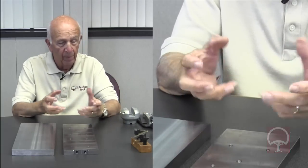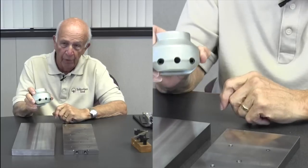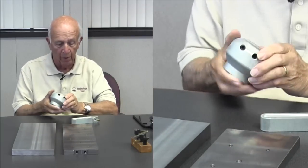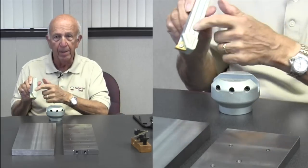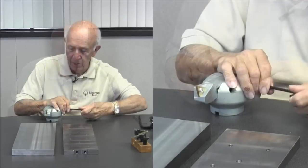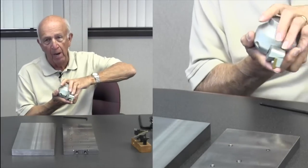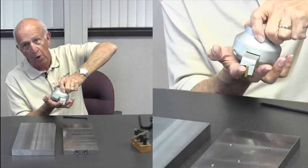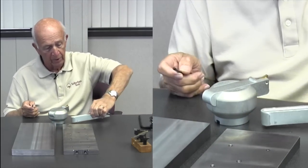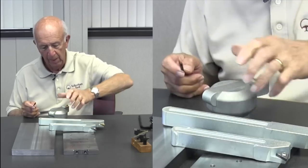New concept, new idea, tremendous difference. Take a look at this. This is the head of the new fly tool. This is the cutter itself, of which there are three. Pocket milled in here. Why the pocket? Let me show you. You drop it in like so. We snug these guys up, and you can actually turn it upside down, so if it's in a machine and you need to adjust it, it's not going to fall on the floor or fall on your part. Kind of cool. And there's three different bars, three different lengths, like so, and this one.